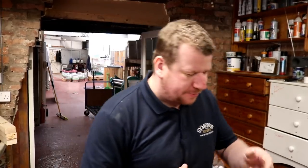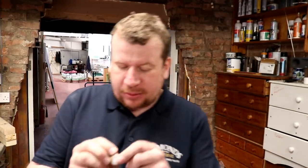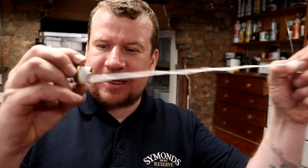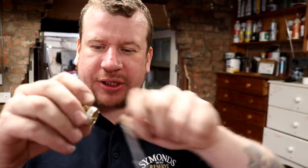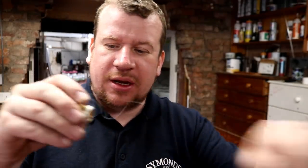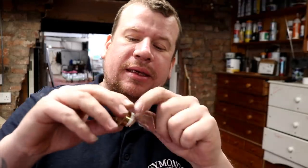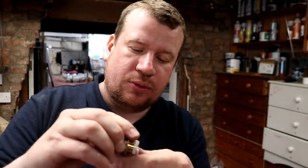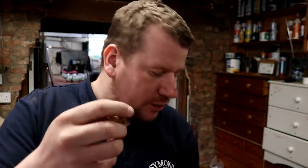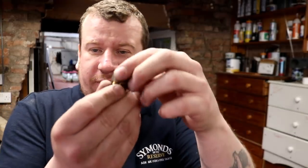No leaks, please. As so often happens, I've been up to Screwfix and picked up the BSP plug, and unfortunately it's exactly the same thread pitch and diameter as their 15mm compression fittings, which is what I tried to use in the first place. So this is basically no good. We can use it for other things though, so that'll just go into stock. It was only £1.60, but because they don't have what I want, I've made my own.